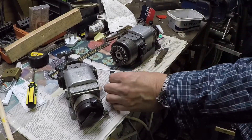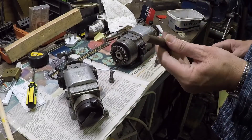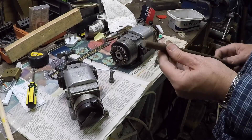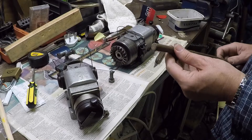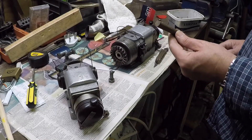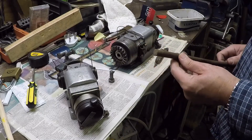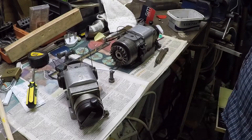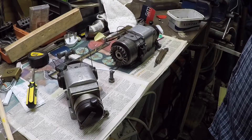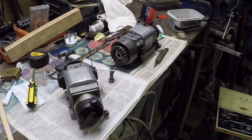So I'm going to make the insert — I'll make it overlong, about an inch or so, and then try screwing it in. When we've got a nice amount of insert we can carefully screw it in and cut it off, and we'll end up with a good strong repair. It could be held in with a little bit of JB Weld as well, but we'll see how secure it appears once it's screwed in. After all, once it's screwed in and wire-locked on the aircraft it can't actually unwind.